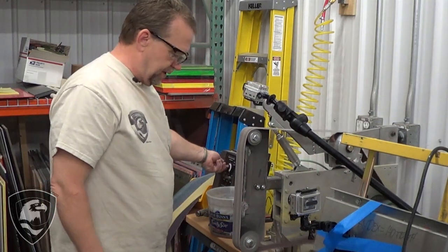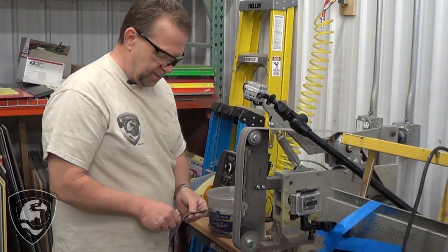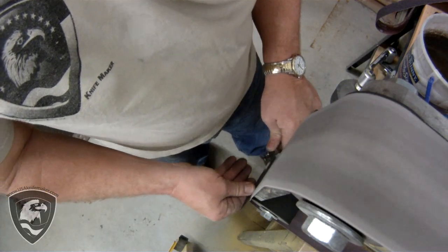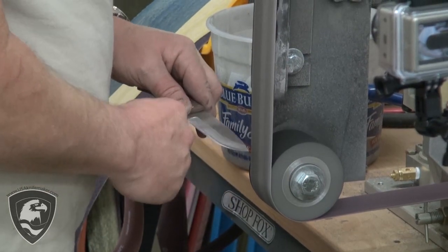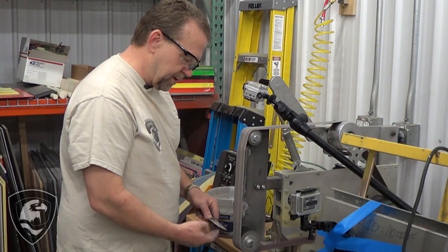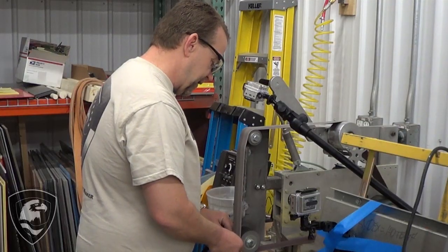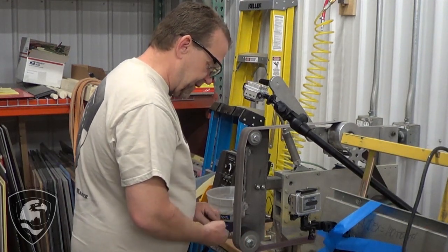I've got the speed down. I could go full speed, but that generates so much heat so quickly. Keep your speed down, keep your heat down so you don't wreck the edge. Now I'm going to feel which side has the wire edge — this side — so that's the side I'm going to start with. Just those few speed passes and I already moved the wire edge from this side to this side, just about the whole length of the blade. Now I'm going edge down just to show this for the video — I don't like to grind edge up when they're this sharp, so I'll switch edge down after this pass.